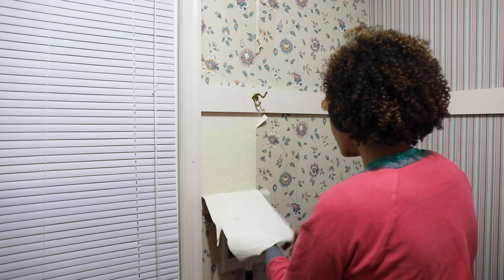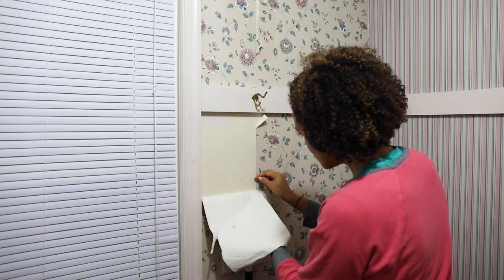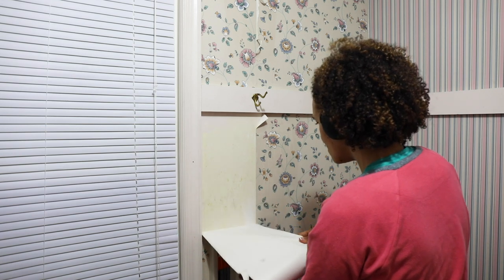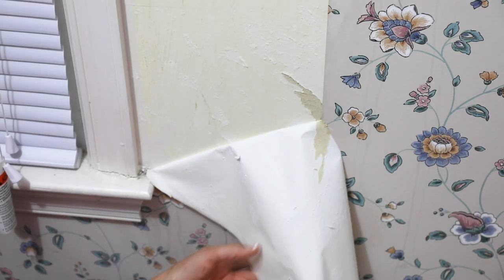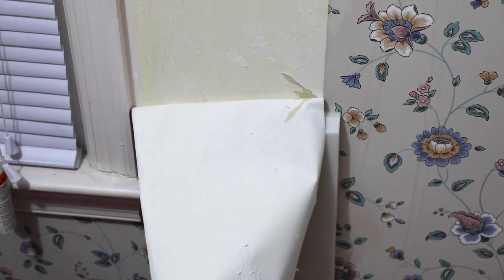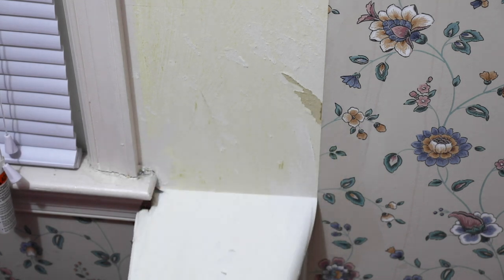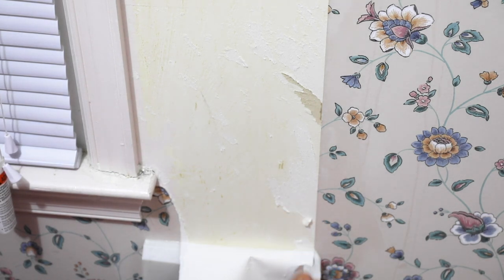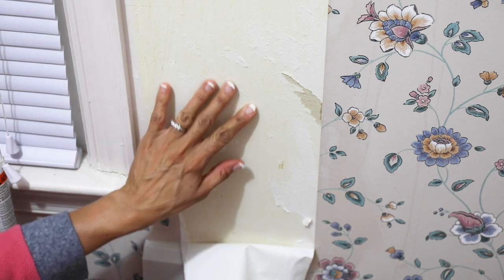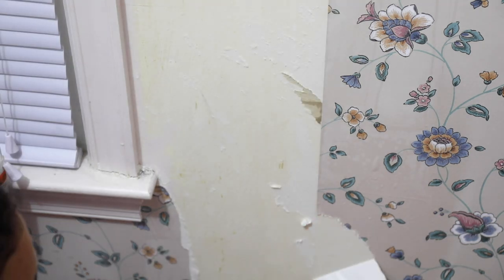You'll notice I'm pulling the wallpaper off as it loosens up with the steamer underneath, then I'm able to pull it from the wall. You want to make sure you're not going too fast. Look closely — you'll see a brown paper bag area. Don't freak out, you're not going to totally ruin your house. You'll also see paper left on the wall that came off the wallpaper, because there wasn't enough steam applied. This is kind of normal — all the wallpaper I've removed in the house, you will get paper that pulls the drywall. I'll show you how to correct for that.